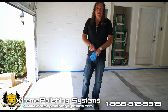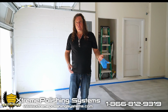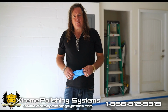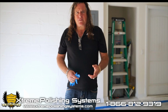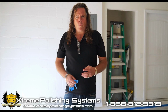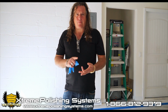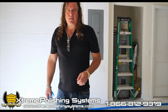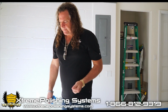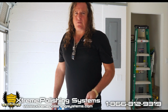I want everybody to know out there, if you want to do the system all in one day, you can do it. It's just going to be done with a different material that dries literally within an hour and a half to 2 hours after you put the first coat down. You can get on with the second coat. So you can literally do one garage in one day. Grinding, prepping, putting your primer coat, your base coat, and your top coat. It's going to take you about 8 hours to do that, but you can do a garage in one day, okay? And we'll be doing one of those videos probably next week, so stay tuned to make sure you watch that one also.